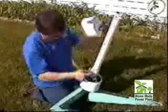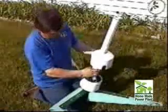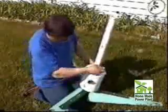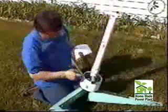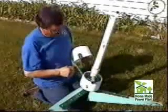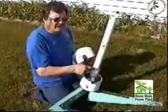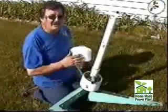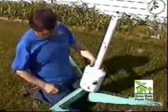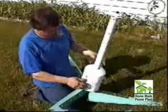Slide this over. After you put the collar on, you can put it on anywhere. Slide this over and it'll push down on the collar, sliding it into position. Line it up over the pipe, push it down. Now remove it and the collar is in place — that needs to be glued there. Put a draw line around it or something and glue it in that position. Then find an o-ring, a rubber band, or a sponge gasket from a house door. Put it on there — it's going to act like a spring so that when you put the pipe cap on, it puts force down on the two-inch pipe. Now you can't get that out; that's in there forever. Then drill some holes around the outside, run in some stainless steel screws, counter-sink them, and that's in there.